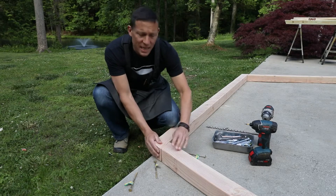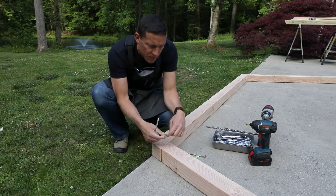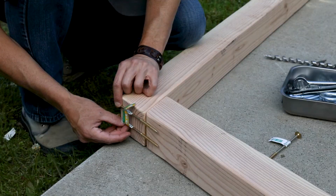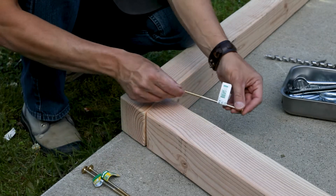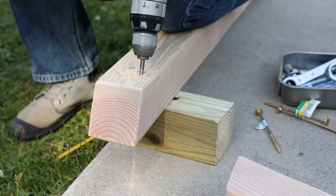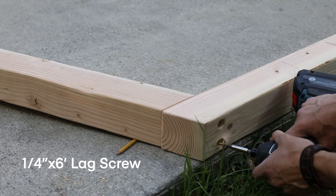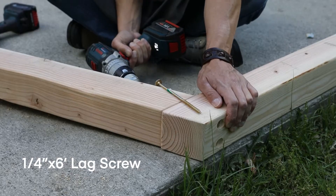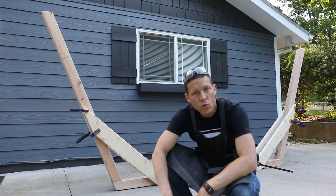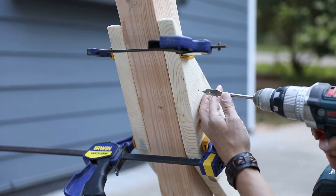This joint needs to be as strong as it can be, but without the supporting brackets of the other wood it's still not going to be strong enough on its own. What we're going to do is take two quarter-inch by 6-inch long lag bolts and screw them from the center from the bottom up — they will end up inside there. Then on the opposite side from the center, there's going to be one going that way. I took the two sideboards, clamped them in place, now I'm going to drill them and lag them together. I have a huge drill bit to go through the whole thing, but I'm going to start with the smaller one first because it'll be easier to line up.